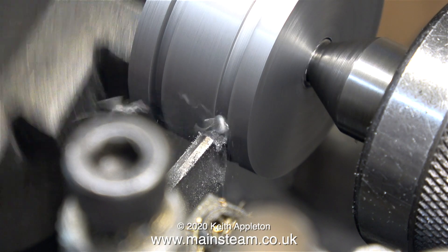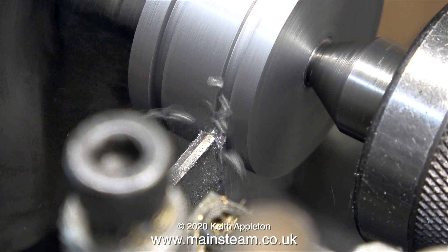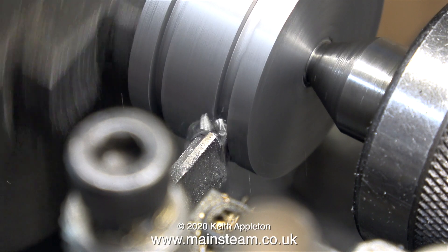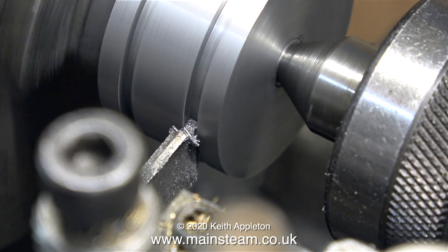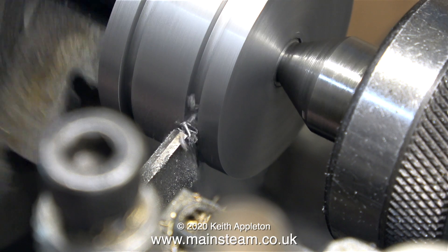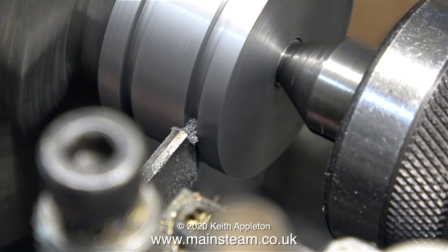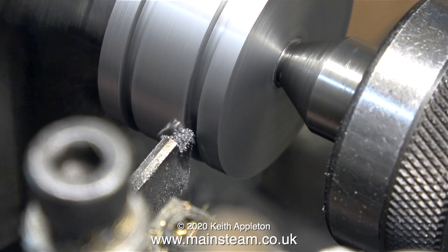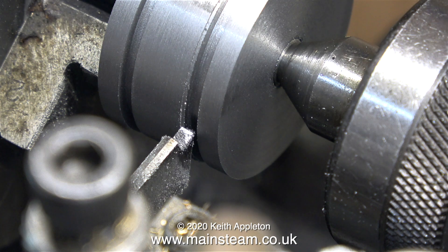All I'm doing at the moment is making two grooves equidistant from the outer edge of the piston, and I'm fully aware that this is bad engineering practice because I'm doing it by eye. In any case it doesn't really matter where these grooves are, but by the time I've widened them to accept the piston rings they will both be in the same place at either side of the piston. This is a slow process requiring patience, and here I've moved the parting tool to the left to widen the groove.